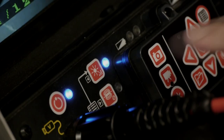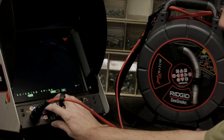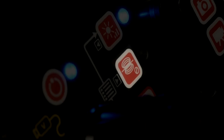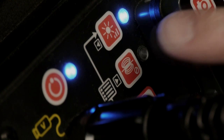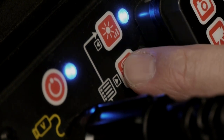You can use the monitor's brightness key to raise and lower the camera's light output using individual presses or by holding the key down. The sonde key turns the camera's sonde on and off — press the key once to turn the sonde on and press it again to turn it off.